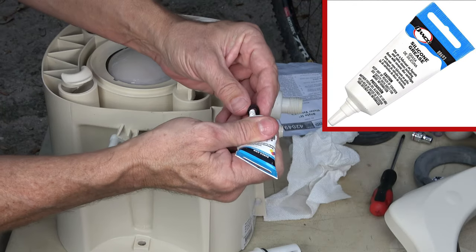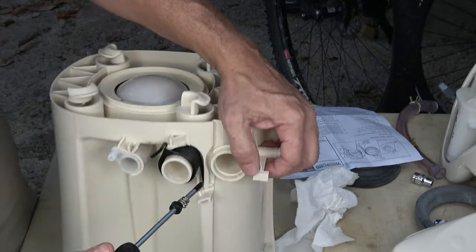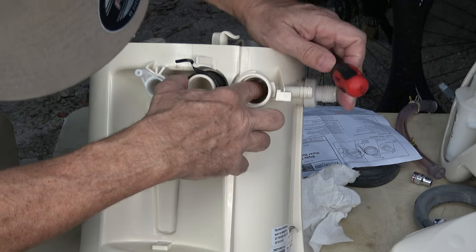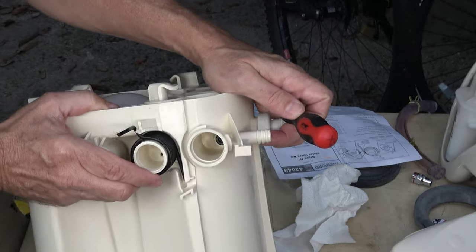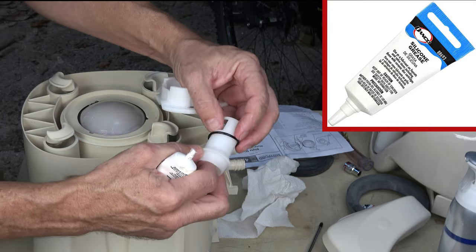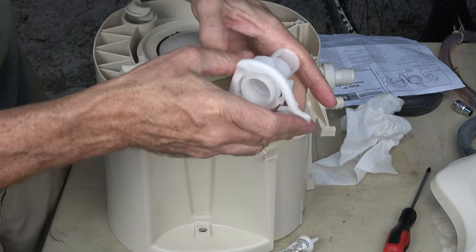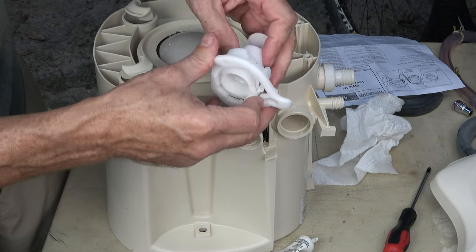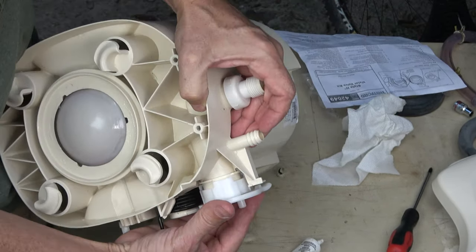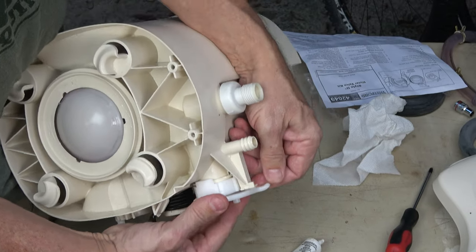Apply plumber's lube to the water inlet seal. Put the water inlet seal over a screwdriver shaft, then put the compression spring over the driver — big side over the driver first so the small end of the spring goes into the valve opening first. Use the driver shaft to direct and align the water inlet seal and spring into the water inlet valve opening, and use your fingers to seat it well. Rub plumber's lube on the o-ring that goes around the water valve cartridge. Put the water valve cartridge through the cartridge retaining ring, watching for orientation. Insert the new water valve cartridge and retaining ring, making sure the interlocking notches on the locking ring and the base align. Push in while rotating the ring until the tab locks into place.